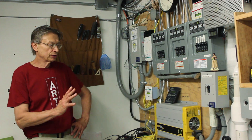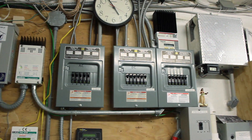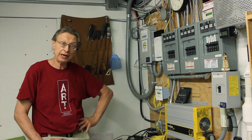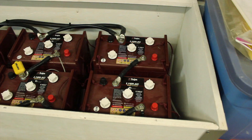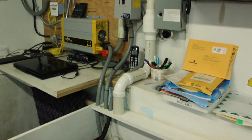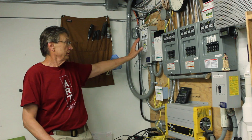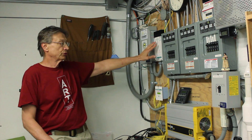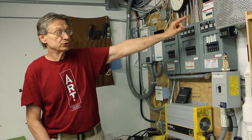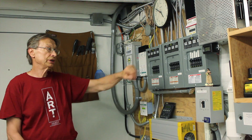Here's a quick overview of the controls of the system — not as scary as they look. Once you make your settings, it's pretty much all automatic. I recommend a qualified electrician; I was fortunate to have Matt Sherald from Pimby Electric — that's Power In My Backyard, pimby.com, if you're anywhere near West Virginia. Here's the solar coming in from the panels on the pole in front of the house. These are just disconnects. Here's the solar charge controller — it is the slave to the master TriStar hydro charge controller, which is also a diverter that diverts excess electricity to the dump load.